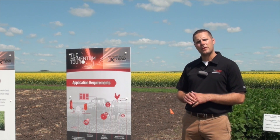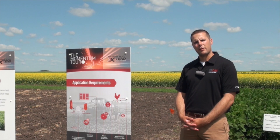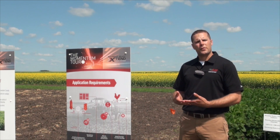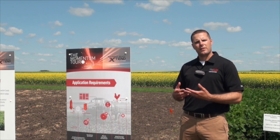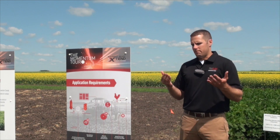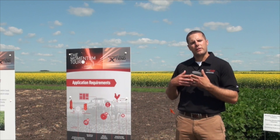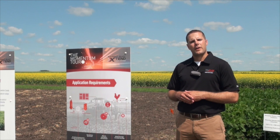Some of the ways we'll be actively promoting to make sure we're using dicamba and glyphosate responsibly is by making sure growers are using nozzles that produce very coarse to ultra-coarse droplets, really minimizing the percentage of driftable fines that can move across a field. Making sure that sprayer speeds are lower than 25 kilometres per hour, because as you increase speed you have to increase pressure, which has a higher potential for smaller droplets and more drift.